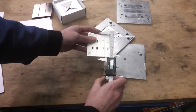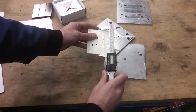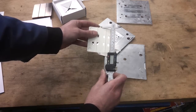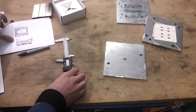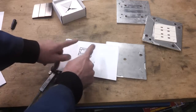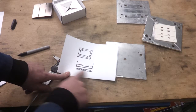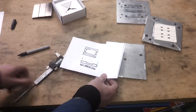But if I actually measure the finished moulding I'm getting 86.07mm. So that has shrunk by about half a millimetre, and that's pretty typical with plastics. So when it comes to making this I've got to basically cut the thing about half a millimetre larger than I need so that when it shrinks it will be exactly the right size for the glass plate that's going in.